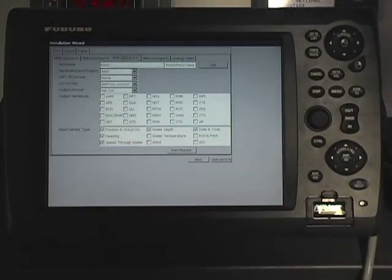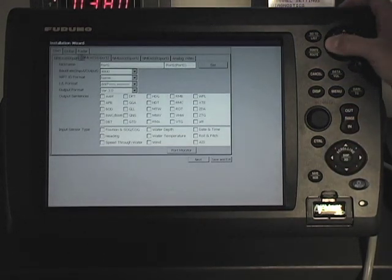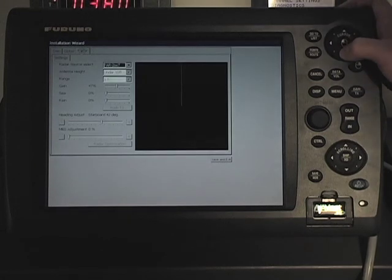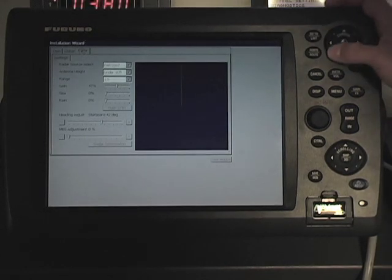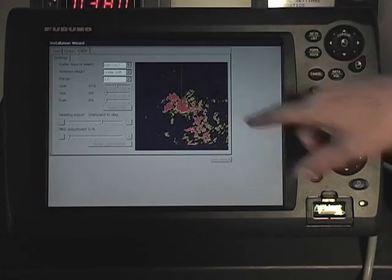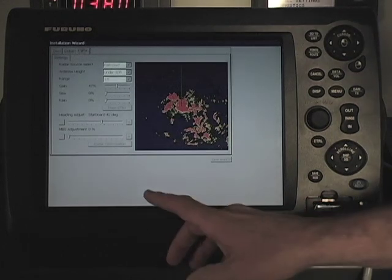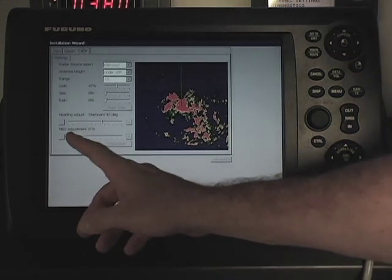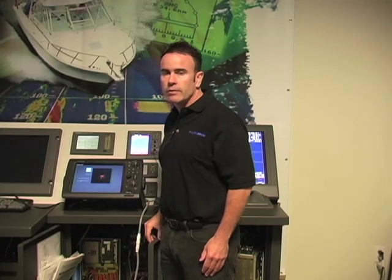Once you've verified that sensor information is present, a quick check to make sure that the radar targets are making it from the X7 series radar over to this MFD 12 is to click on the radar tab. Once we do that, you should see the targets appear — and basically you've accomplished what you set out to do. Note that the adjustments for heading and main bang don't need to be touched, because all those settings live and exist with the X7 series radar — we're just passively looking at the Ethernet data for radar. So once that's done, you're good to go with radar targets from the X7.